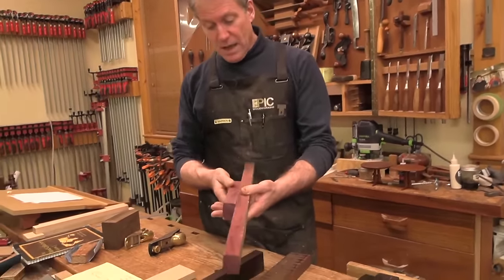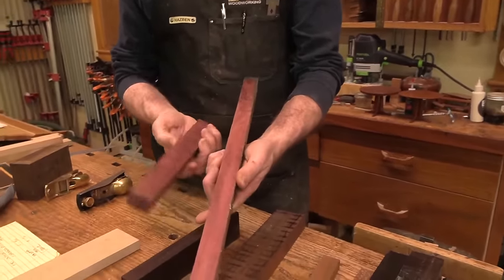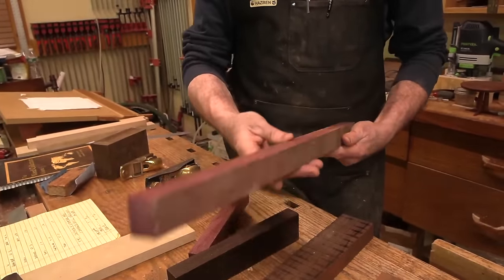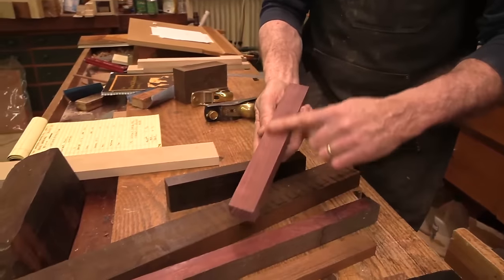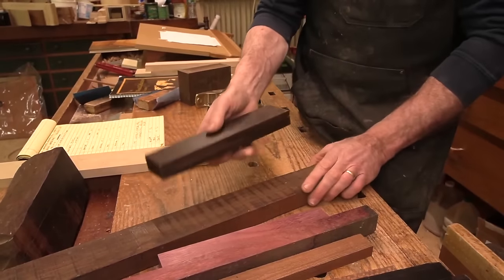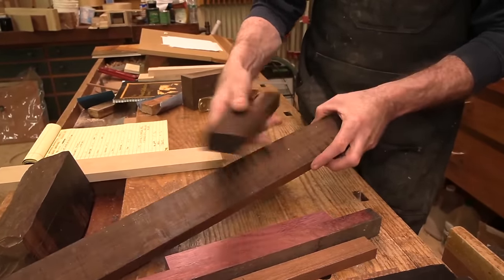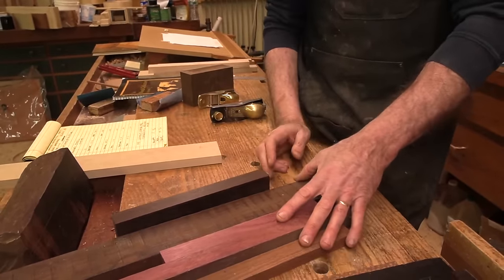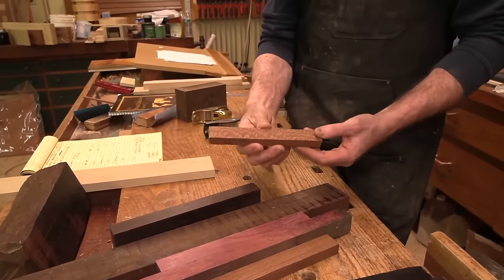I do not like bloodwood. But another redwood that's really more pleasant to work with is purple heart — and I've got some right here. It's pretty obvious why they call it purple heart; it has that color, though over time it will lose some of it. This is a smaller piece I just planed and it looks a bit darker right after planing. Same with cocobolo — this piece I planed looks almost black, but it does get those warmer brown tones back after it oxidizes.